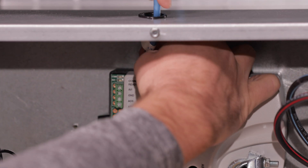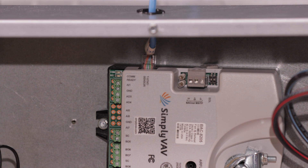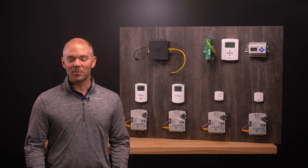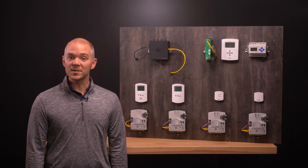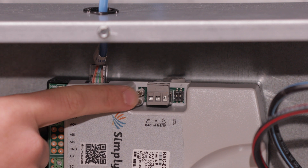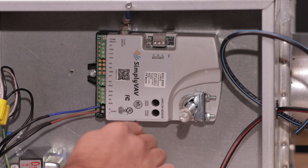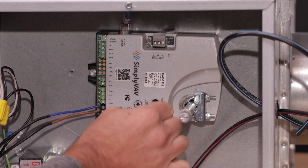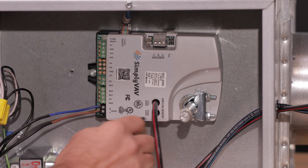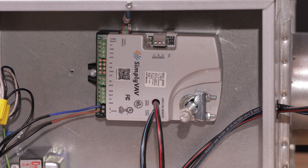Next, connect an Ethernet patch cable to the dedicated sensor port. This will be used to connect our digital sensor to the controller. If you are planning on integrating into a BACnet network, your controller MSTP network wiring will connect to the gray terminal block and daisy chain to the next controller. Finally, connect the airflow sensor. In this example, we are using the flow pickup that is supplied with the VAV box. Connect the high side of the airflow pickup to the high port on the controller and connect the low airflow pickup to the low port on the controller.